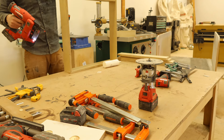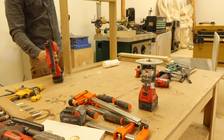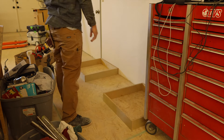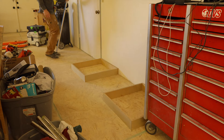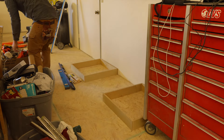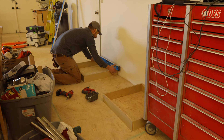I'm using Rue glue on this pre-finished plywood so that it sticks. That stuff is for melamine and really non-porous materials. I'll set these toe kicks down, get them all leveled up, shimmed and level, and then it's easy to just set the cabinet boxes right on top of them.